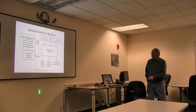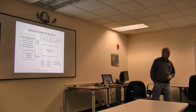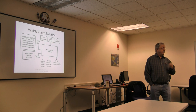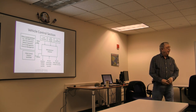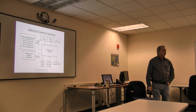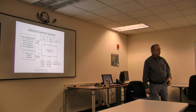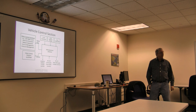But on the way down, the downlink is 144.390, which is the standard APRS frequency. And we're careful with what we are going to put out on that line. We don't want to just jam the channel with lots of data, okay? So we're going to send position reports every minute, and a telemetry report every minute. And every once in a while, status updates and additional telemetry. But we're gonna try and not flood it, okay?